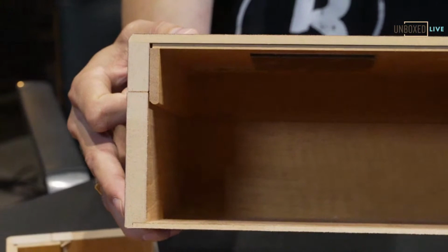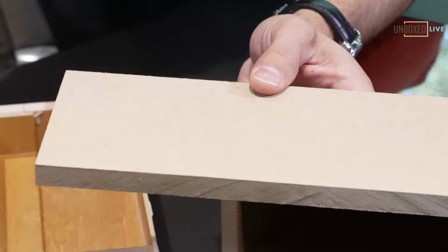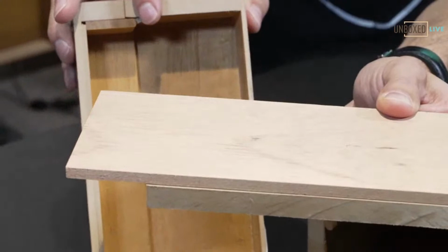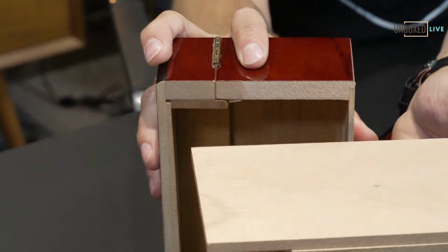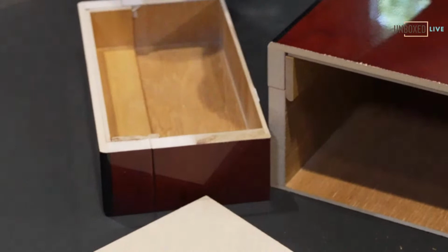So if we look at that material, this is MDF, guys. This is glued pieces of fragments of wood. Sawdust. And then this is actual hard Spanish cedar, and it's basically laid on there like that. Now, this is way thicker than obviously what this is, because this is paper thin. You can't even tell where it starts right here. And then obviously a laminate wood on the outside. And again, that's not a hardwood. This stuff exchanges moisture really well, and in fact, if we were to pour water on these types of products, they absorb moisture real quick.